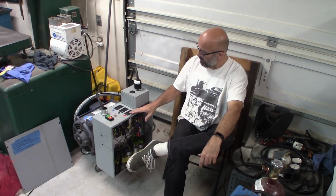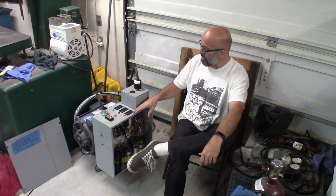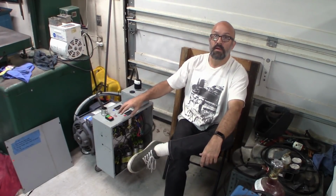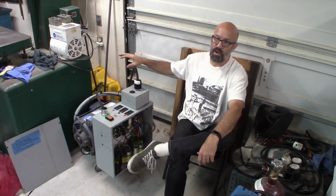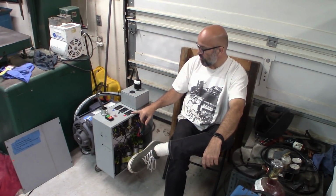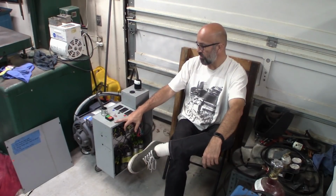Did get these little volt and amp meters hooked up, and they're actually running off of the three-phase lines. After getting that set up, I did kind of realize I probably should do one more, put over here, and have it on the incoming power. Because normally if I'm not running any equipment, these all just register zero, so I don't actually know how much the idler motor is pulling in amps while it's just sitting idle. So having one more of these little meters, they're pretty cheap. I think they were $13 each or something. I'll order one more of those and mount it over here.